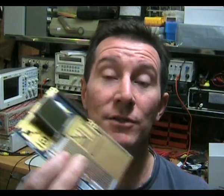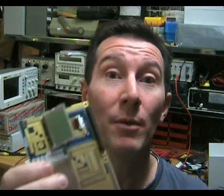And sure enough, that was much easier to debug, and I could see it on my screen. I could see on my scope that the timing was perfect and there was nothing wrong with it, and it wasn't a hardware issue, so it had to be in my driver code. And sure enough, once I dug deep enough, I eventually found that I was missing one code that I wasn't feeding the screen, and bingo, it lit up like a Christmas tree as soon as I added that code. So it really took going to serial mode in order for me to be confident that it wasn't my hardware, it was actually my software.